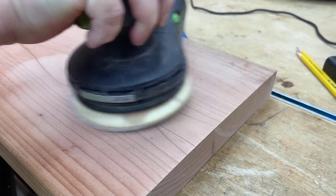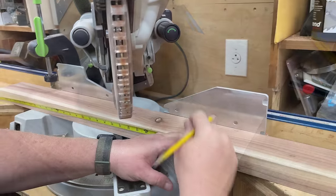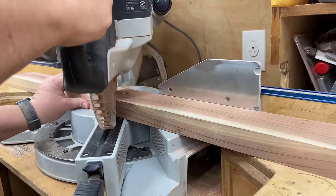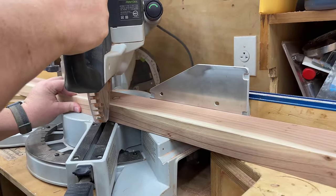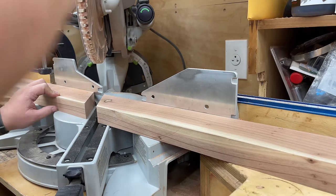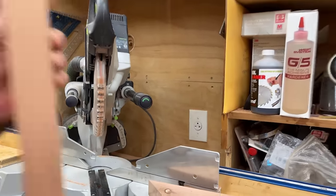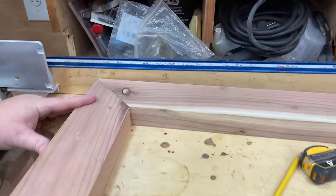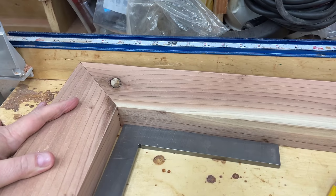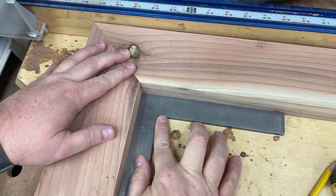The first ripping was to get the two by twos for the top. Now I'm cutting the perimeter board — it's a two by four that goes all the way around the top. I've cut it at 45 degrees here, and it's important to check this. You can cut it on a table saw with a sled, or on a chop saw if your chop saw is accurate. Just cut a 45, put the two pieces together, and put a square up in the corner — it should be spot on. If not, you can adjust your chop saw to cut accurate 45 degrees.